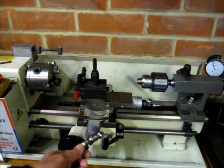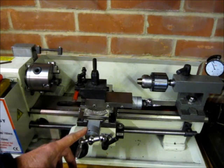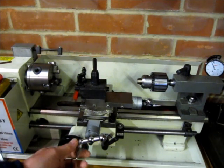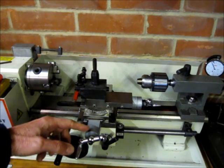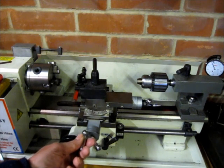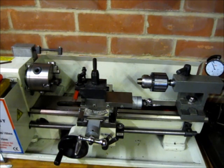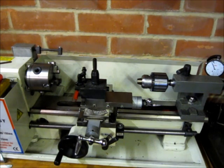Just to make things a little bit easier. You can buy kits to convert these to digital readout, but the problem with them, apart from the expense, is that they are rotary encoders, so you will need a rotary encoder and a longer lead screw, but you still have the problem in that they don't take account of backlash. So what I want to try and do is fit a low-cost digital readout which directly acts on the cross slide and is independent of backlash.